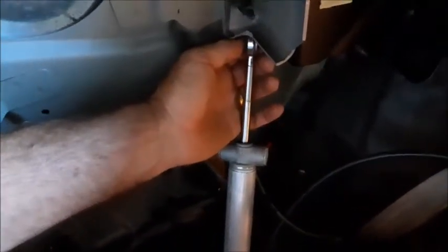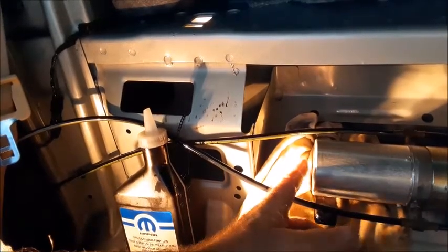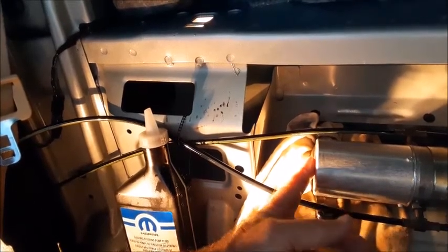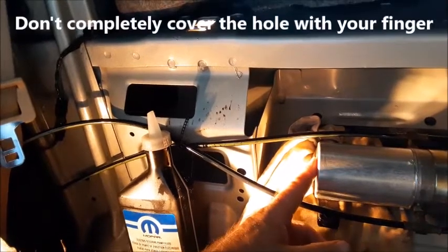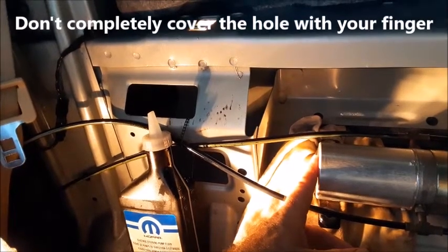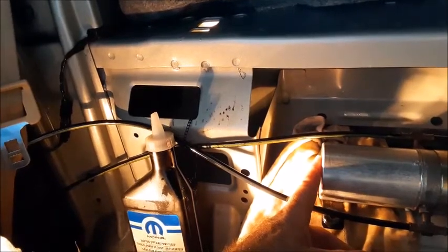Be careful — these cylinders will just lay right here. I didn't realize I was jamming the cylinder into the top of the frame, wedged underneath the floorboard of the seat, so make sure these are nice and clear before you start trying to extend them to bleed the system. Run the top back and forth several times with the plug out. The fluid level will change slightly as it goes close to the bottom or close to the top, so you can put your finger right on the edge to make a little dam to keep fluid from running out as you work the air out. You'll hear bubbles coming through the hoses. When done, you should be able to do a full revolution up and down with the cylinders disconnected from the convertible top.